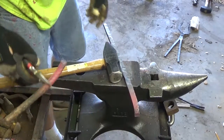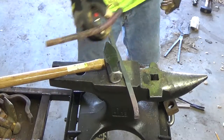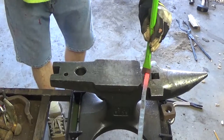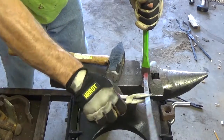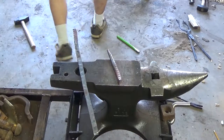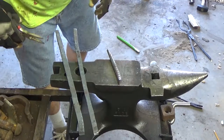If you were to get that last strike it goes flying across, and obviously you don't want red hot metal flying across the shop, especially when you've got a lot of combustibles. So that's a good thing to keep in mind. Go as far as you can and hook a little shift bend right off — like so. Now we've got two bars roughly the same size and diameter. We'll just square them up a little bit and make them look exactly the same, or as best we can, and then we're ready to move on.